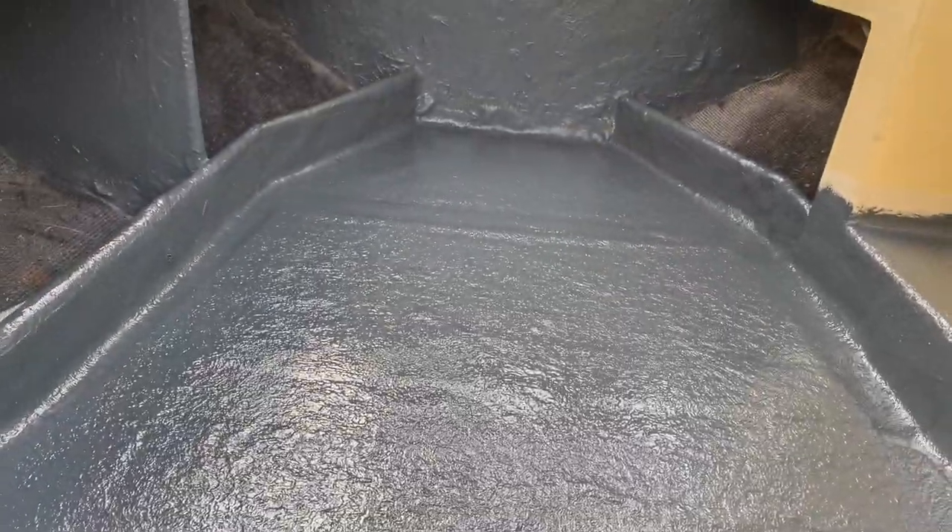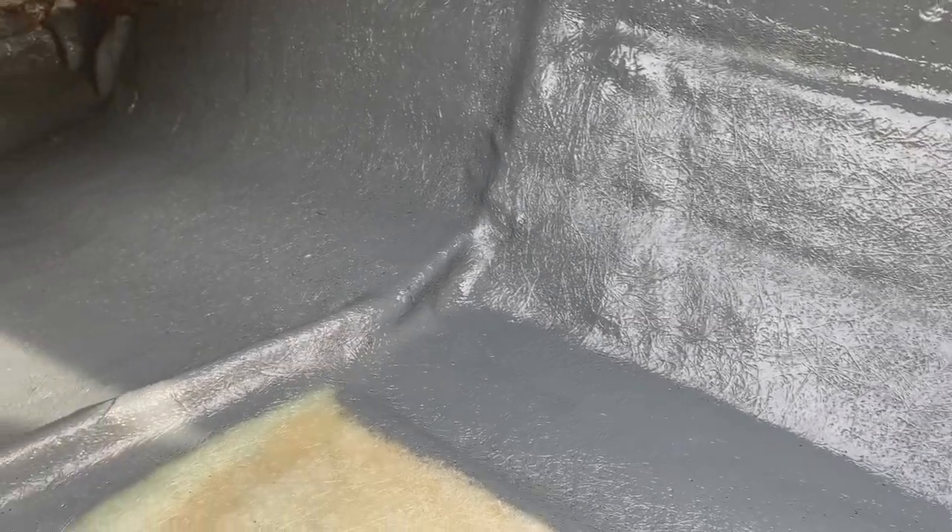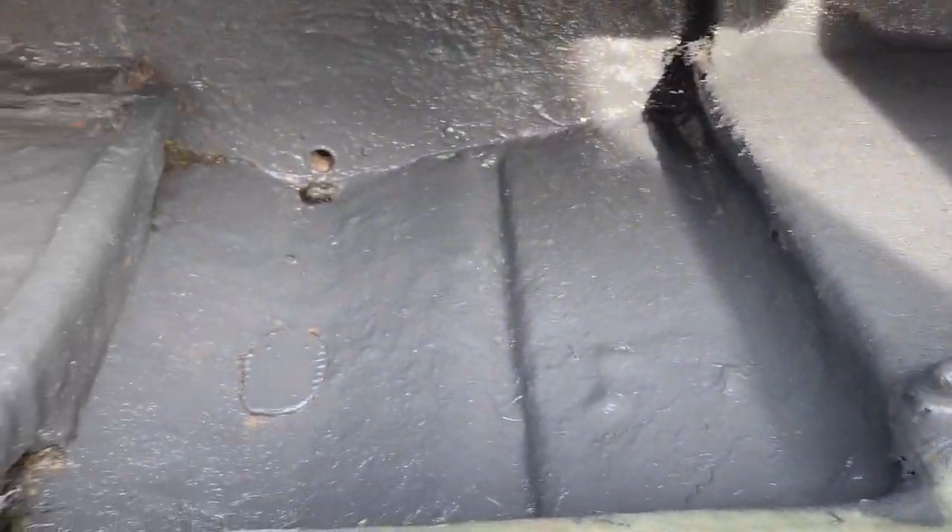I'm finding this incredibly easy stuff to work with — this flowcoat — and a little goes a long way. I've used probably 750 mil just to do this section here. I can put it on loads thicker because you can still see the fiberglass coming through, so what I'm doing is putting one coat on, allowing it to dry while I do another bit, and then I'm going to absolutely cover it with the remainder so it goes smoother.